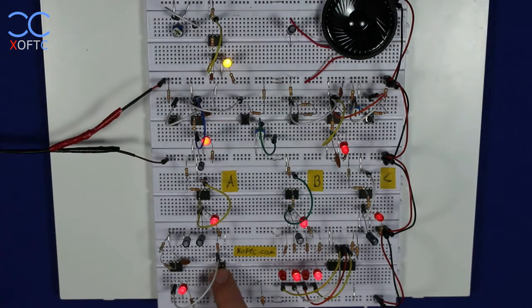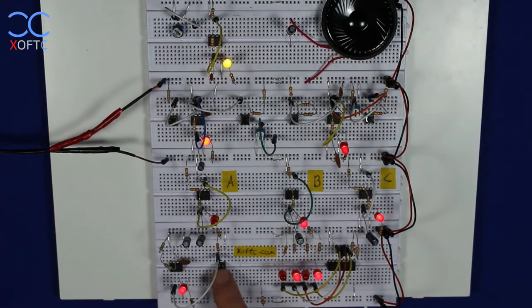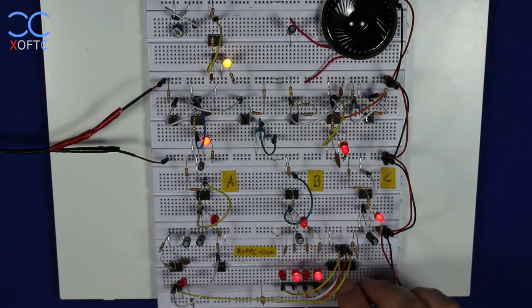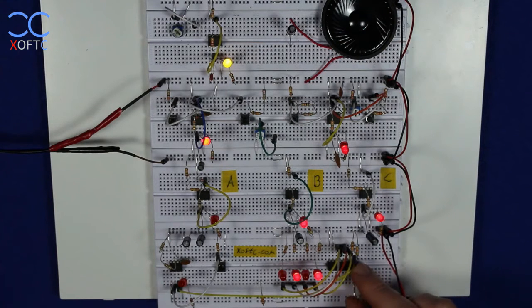And if I press the button repeatedly, it will generate the same pulse, 2.2 seconds, and then afterwards it will generate another one, but it won't turn on and off at the rate that I'm pressing the button. So to demonstrate this, I'm going to take the output pin of this monostable timer, and I'm going to connect it to the clock pin of my binary counter.